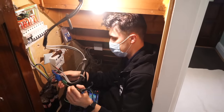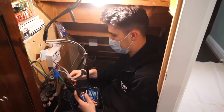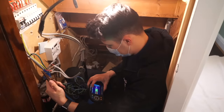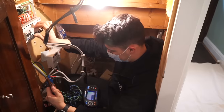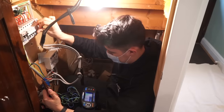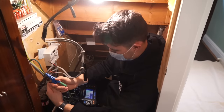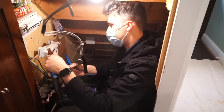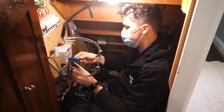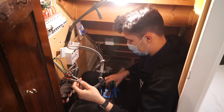Yeah, so what we'll do now, just to be sure, I'm going to switch those circuits back on and see if this comes live. So, so we don't blow a fuse in the meter, switch to voltage. Yes, I'm getting 2 volts. You can hear how those breakers sound a bit poppy. Yeah, 2 volts, 1 volt, 1 volt. It's just transients, I think. 4 volts down to 1 volt. 5 volts down to 2 volts. Yeah, just induced current.